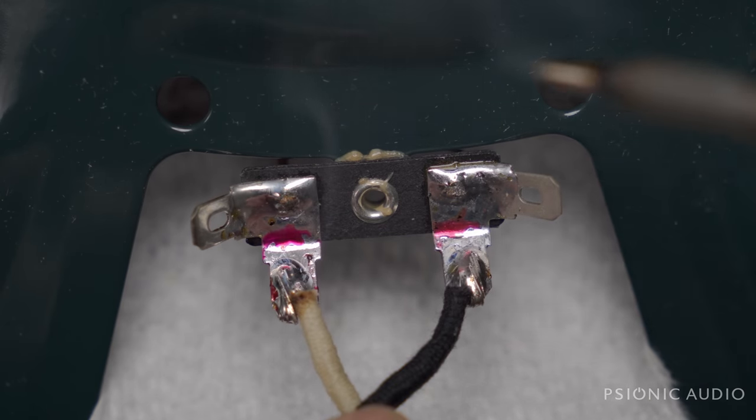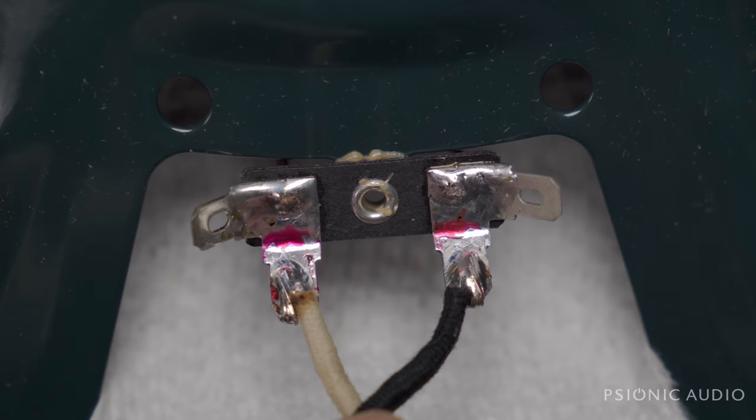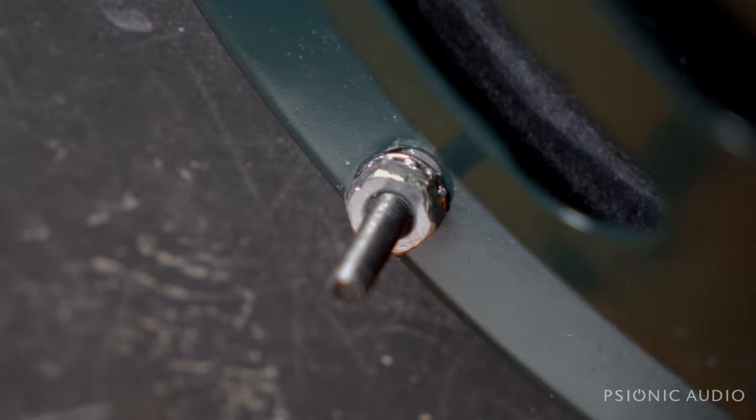As the speaker had been installed so poorly, the new one is being installed well. Each of them has a number 8 washer and a number 8 Keps nut. The other three screws on the speaker got new ones — this is the remaining original.